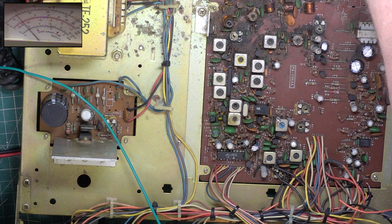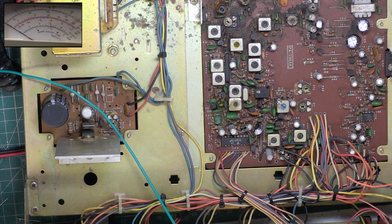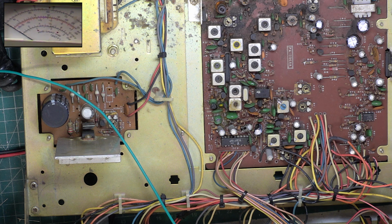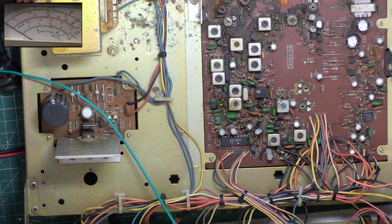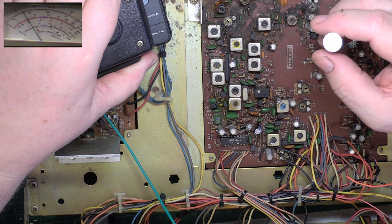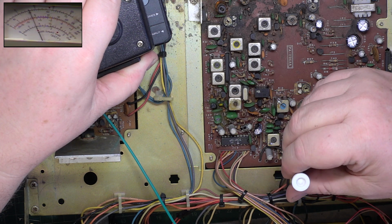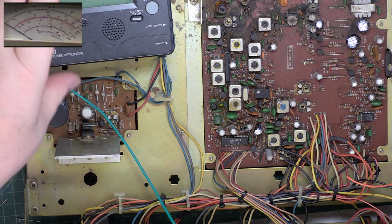Is my aerial in properly? Yeah. The frequency is 27, I'll show you that. 27.79143, so it's still slightly high, which is fine. There's nothing I can do about that. It's just a fixed crystal with no means of adjustment. So we'll get the deviation up, and I forgot my little chromatic tuner. And it's VR5, which helpfully says deviation on it. Set that for 2 and then we'll just do a whistle. Whoa. That's actually spot on, 2.2 to 2.5.